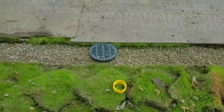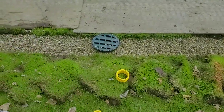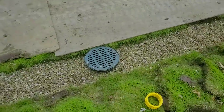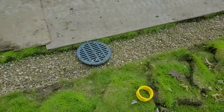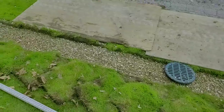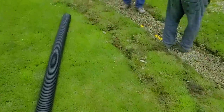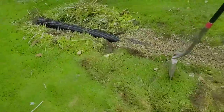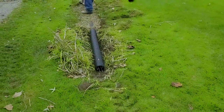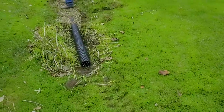I love these basins. They're about 16 inches deep and have legs so the frost can't pick it up. You put the dirt over beneath the legs. I'm going to shoot a video on this — that is the best and strongest basin. I'd use that 12-inch round anywhere in the United States, and I'm going to teach you how to use them, when to use them, and what they're intended for. They're not intended for a French drain — they're intended for yard drains. There's a difference: French drains are the ones you see as a burrito wrap, yard drains are when you take bulk water and take a solid pipe somewhere.